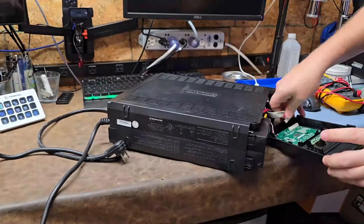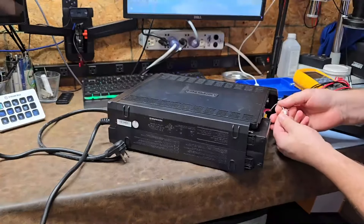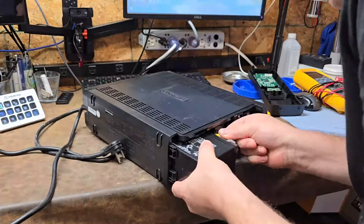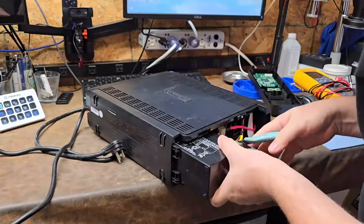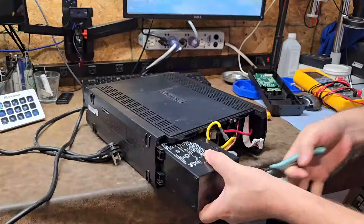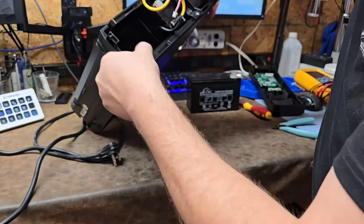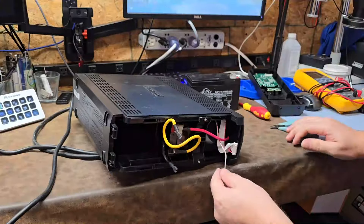Here are my batteries. Slide them out — the batteries are warm, considerably warm, because they've been charging for a month. I've got two spade terminals and a 12-volt 9-amp-hour battery. There's a second one up above — they have them in series. There's one strap holding the top battery in, and the jumper that puts the two batteries in series.